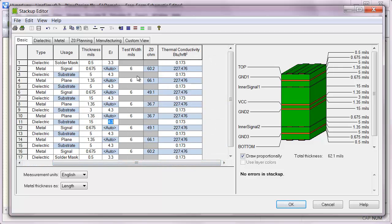If we look at what a test width of 6 mils would produce here: on our outer layers a 6-mil trace will produce a 60-ohm impedance, and on our inner signal layers it'll produce 49.1 — so almost 50 ohms. This looks like a pretty good starting point for our design. If we reduce that trace width down to 4 mils, on the inner layers we can get up to 58.2 ohms, so almost 60 ohms.